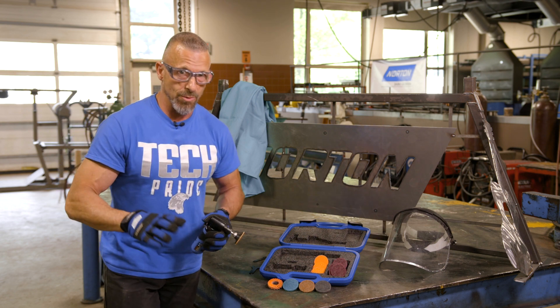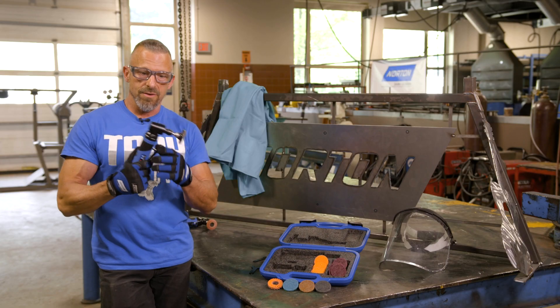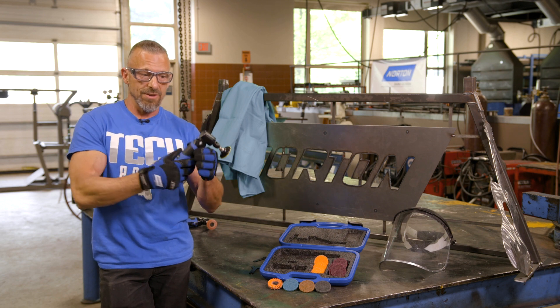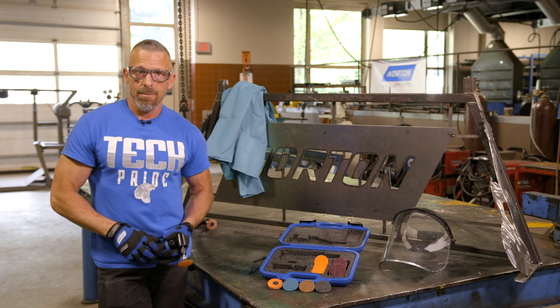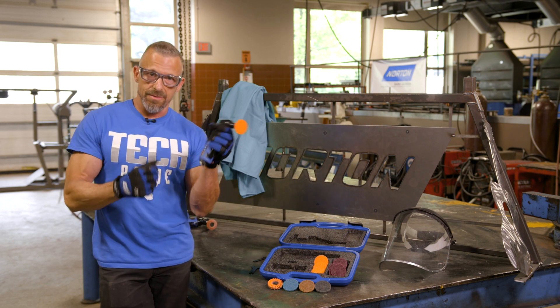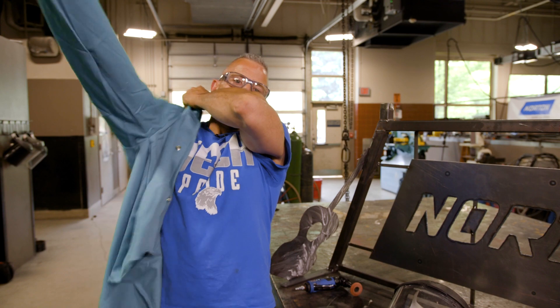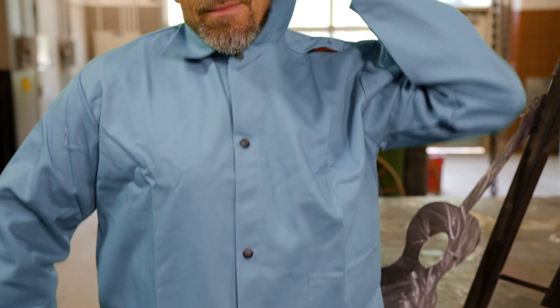I had that happen once and I almost quit welding. You're going to need to wear gloves — pick gloves that are suitable for what you're doing. This is a small grinder, not too many sparks, so I don't need big gloves, plus I'll have good finger dexterity to use this grinder. Other times you may need bigger gloves, but pick the right size for whatever project you're working on. You're also going to need long sleeves — I usually wear a welding jacket, but a flannel shirt works, anything to protect you if it breaks apart from hitting directly onto your skin.